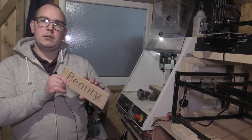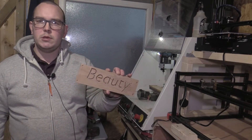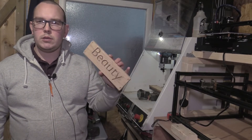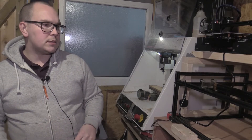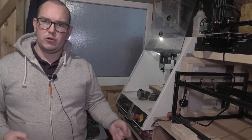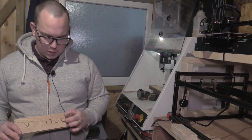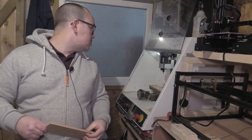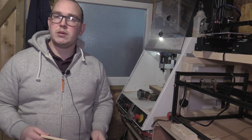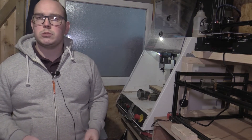I've got that job finished off. It's from my sister-in-law's beauty room that she has at home — just part of the sign that I've made. It'll be backlit eventually. I'm quite happy with how the router performed. The only thing I would say is it was very loud — it was set on the highest speed which I believe is 30,000 RPM. The other thing is I didn't adjust any of the G-code; I was only able to put the feed override up to 200%, which might not have been enough to keep up with 30,000 RPM. Just looking at the cutter, it's a bit black on the end so it's got a bit hot. But apart from that it works great — it appeared to be rigid enough. The next thing I'm going to do is look at what I can do to reduce the noise coming out of that machine.